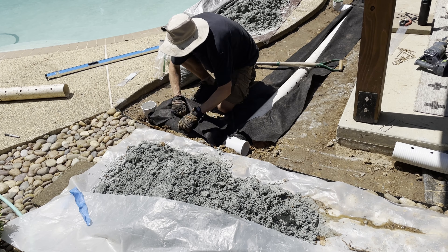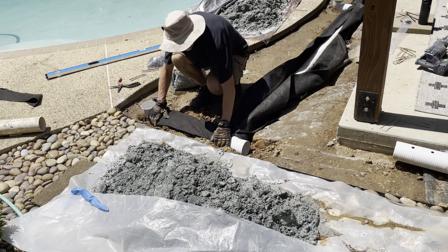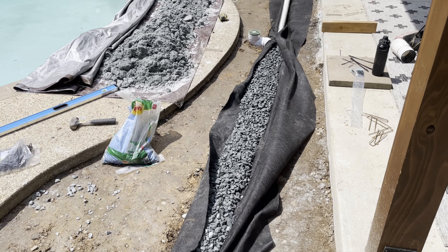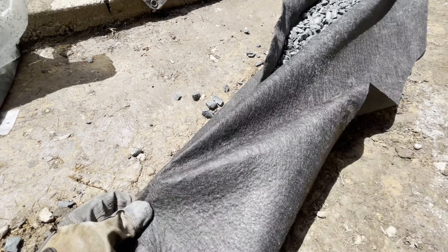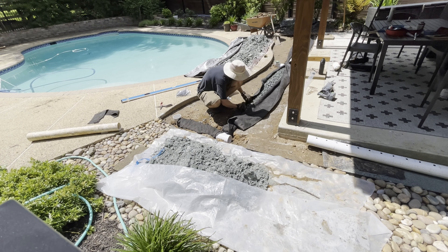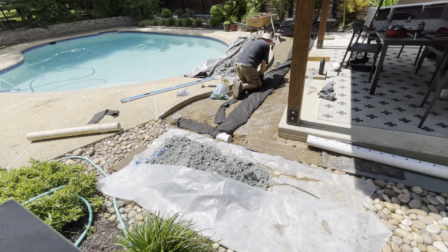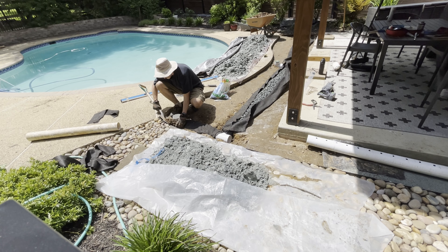You can see how if your ditch was really wide, you'd be putting a lot more aggregate than you need. I put some on top so it's wrapped around and on top. Then get some landscaping staples and just nail that down so it doesn't flop open when you're putting aggregate on top — you want that to be completely filtered. So here it is, the other part. It's pretty repetitive once you understand it. It's packed in and this will cover it up completely. I'm going to put some aggregate on top of this. I ended up trimming the fabric a little because it was extra. Now just wrapping the burrito and then doing some staples to staple it down, and filling in around those joints so they're not going to move.